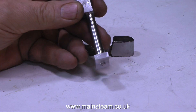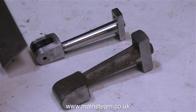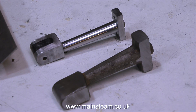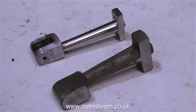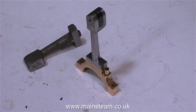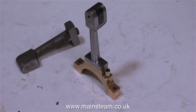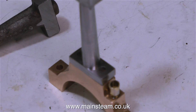I cleaned up the end part on the belt sander to remove all the chuck jaw marks, then I drew on it with a felt-tip pen. This is the approximate position where I need to remove the metal on the milling machine in the next episode. The inner part of the fork is thicker than the outer part of the fork - this is not a mistake, it's how it's shown on the drawing. I've drilled the holes to mount the eccentric rod onto the eccentric, and it's quite a good fit; I'm very pleased with this. By the time you see the next episode, I will have machined the other part to the same stage as this, so it's just a simple job of milling the fork. That's it for now, thanks for watching, and I hope you found it useful.